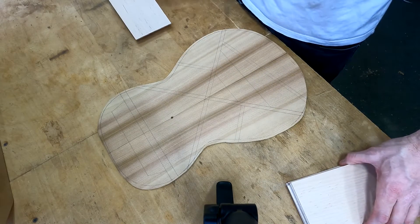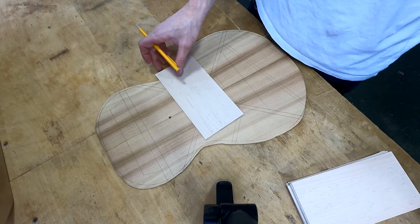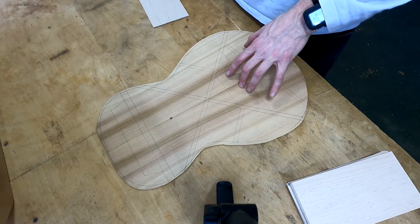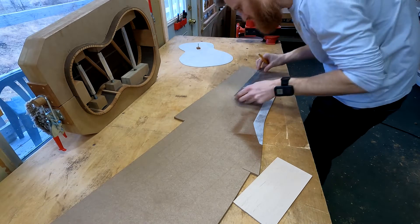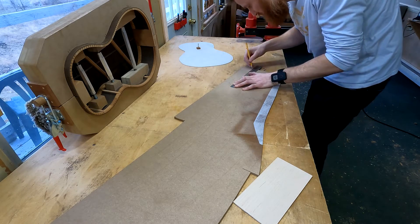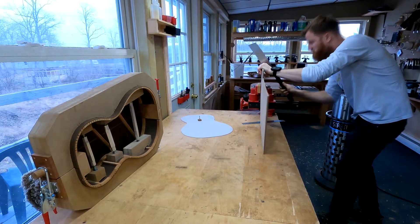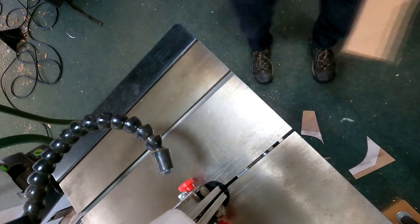All right, let's go ahead and get started. What we need to do is make a template. For example, this is a template for a different model I have, but it's not going to work for these parlor guitars — I have to make a new template, as this bridge plate is a little bit longer. For my template I am using quarter-inch MDF. I can use the template I've already made for my bracing pattern to mark out the bridge plate shape. Since this is such a large sheet of MDF, before I take it to the bandsaw I'm going to cut it down into a smaller, more workable size using a Japanese pull saw, then take it to the bandsaw to cut the shape closer, and then to the disc sander to truly bring everything down to the lines.